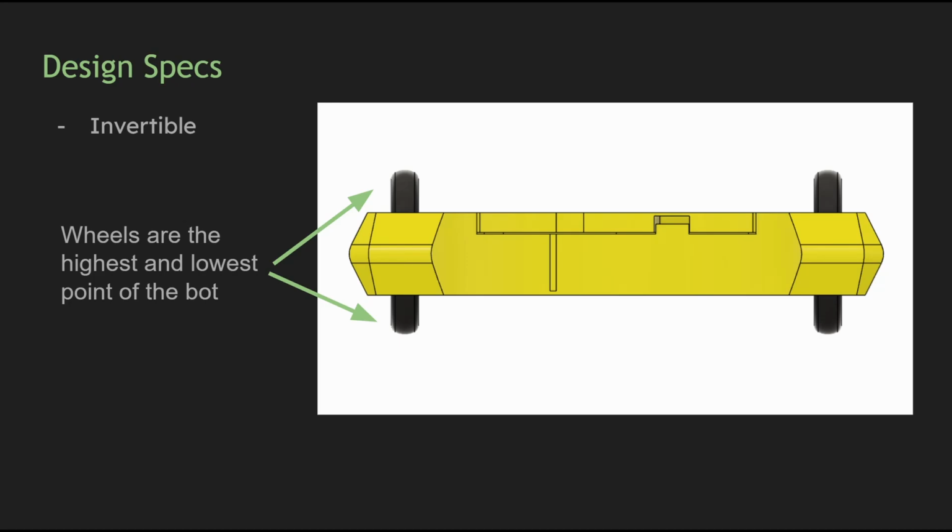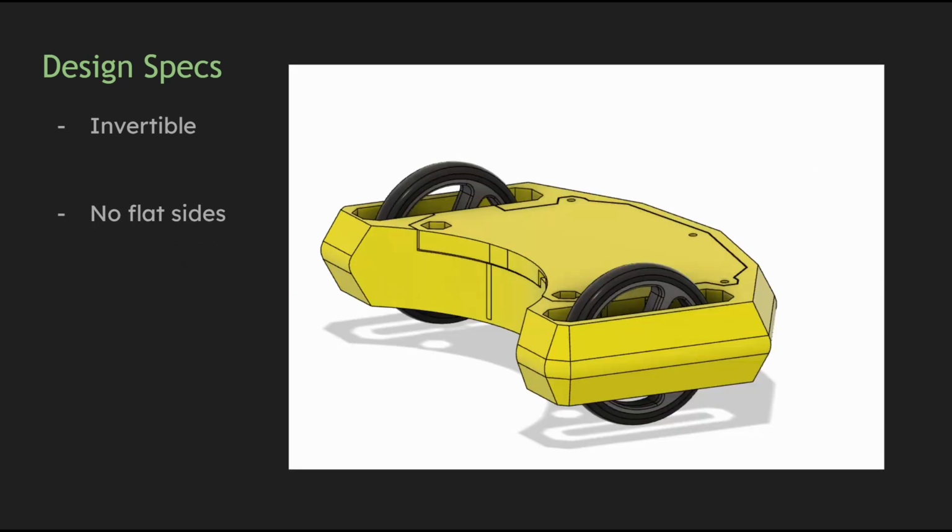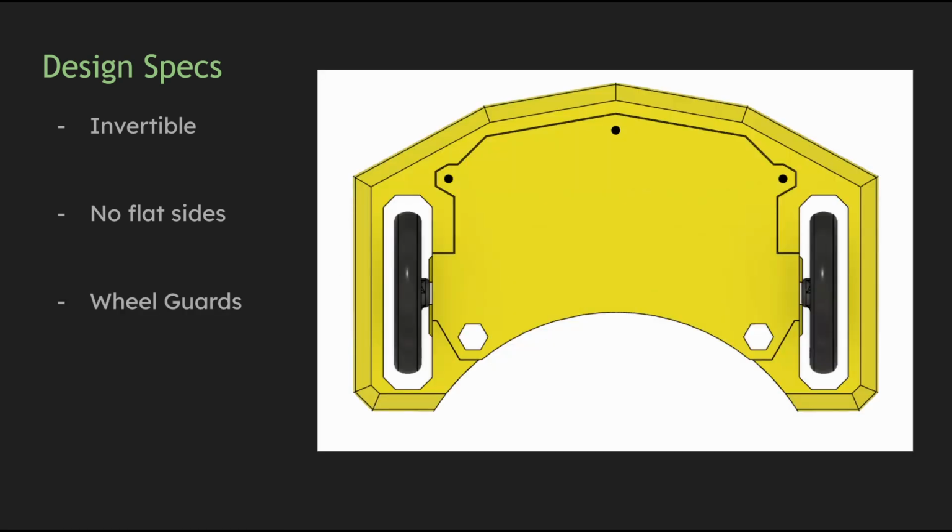The robot had to be able to drive upside down, since I didn't want to waste weight on a self-righting mechanism, and being unable to move is fatal. An extension of this, being stuck on a flat face and unable to get down, was another path to quick losses that really could be easily avoided. A third failure mode I'd noticed was wheels being torn off of robots, resulting in a countout.